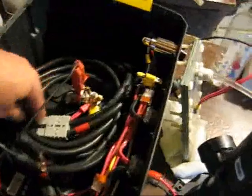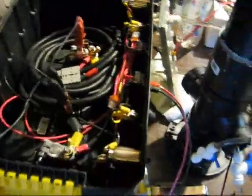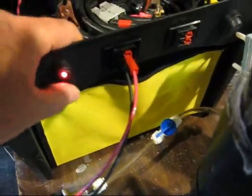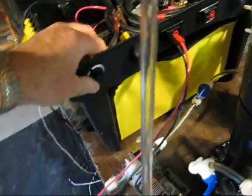Let me show you this battery box. This is a battery box I built for my ham radio operating unit — what they call a go box. It has Anderson connectors that can be disconnected and connected very easily, good for 30 amps. There's a switch that turns it on and off, and some cigarette lighter connections also connected to the same switch, with another set on the other side.